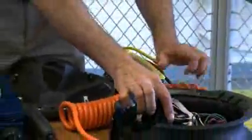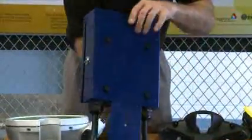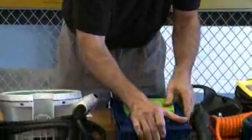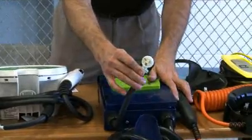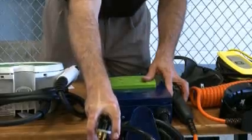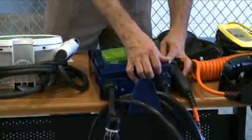The Leviton unit has a different approach — it uses a pre-installation base plate that's screwed to the wall, and it has dowel pins on the back that snap into the base plate. It also is pre-wired with a NEMA 6-20 240-volt 20-amp connector that normally has a lockable enclosure over the plug as another way to meet the national electrical code.